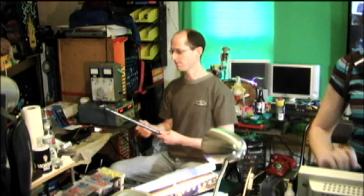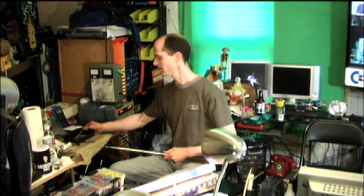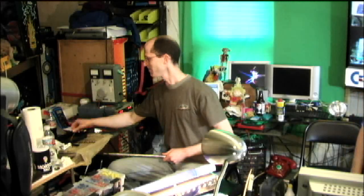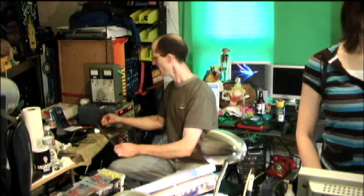It's actually really, really easy. You can do this with just a few 9-volt batteries and some phosphoric acid. You can see here I have this tray of really nasty phosphoric acid, also known as Coca-Cola. And a little bit of a stencil so that you're only applying the patterns where you want it on your titanium, and a little bit of electric current from those batteries.